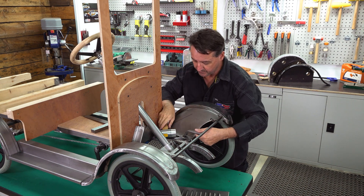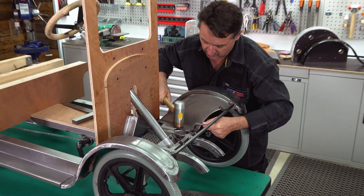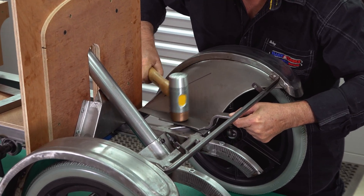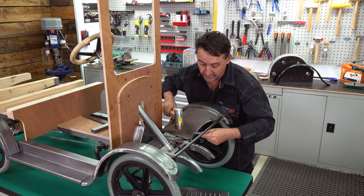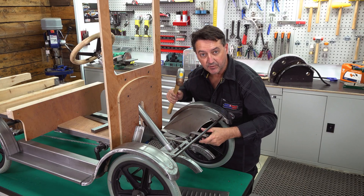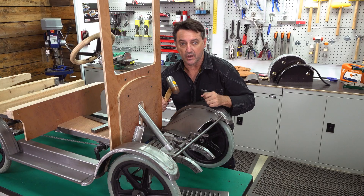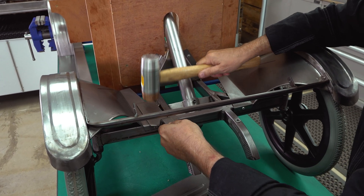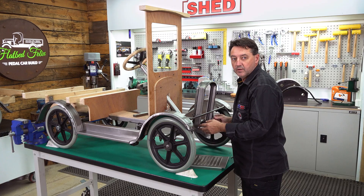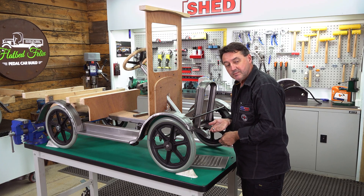On the bottom section here, using a spring hammer, I'll come in from the front, hold this flat, and then from the back just with a good heavy hammer, working this until it's reasonably flat or you've got a tiny little gap between the chassis and the inner guard. The first thing we're going to do is put the radiator shroud on.